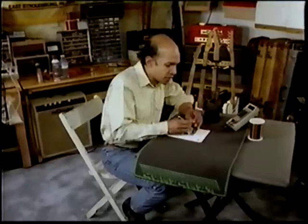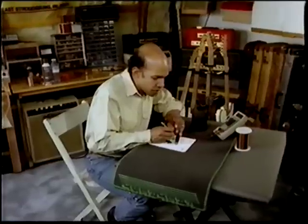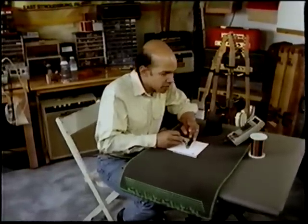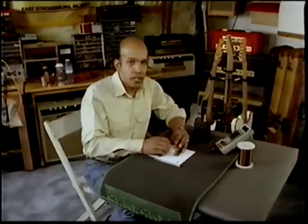First, we're going to start by scraping the wire just where the wire goes into the connecting holes. See if we get a reading. There's no reading, so we're going to have to cut into the coil. Well, you need an X-Acto knife. You cut into the coil. You're going to get a screw and stick it inside that little hole in the center of your pickup coil.